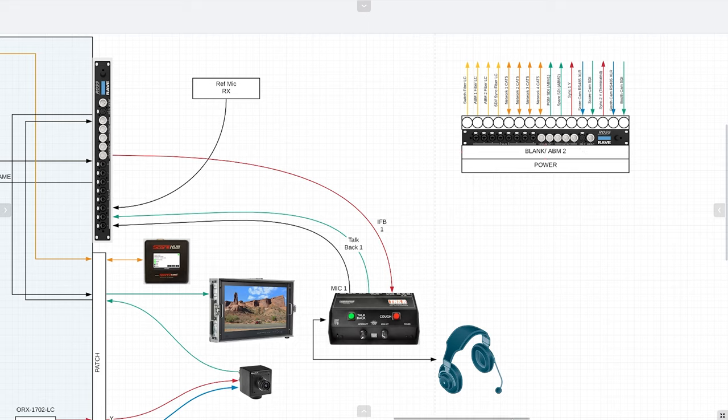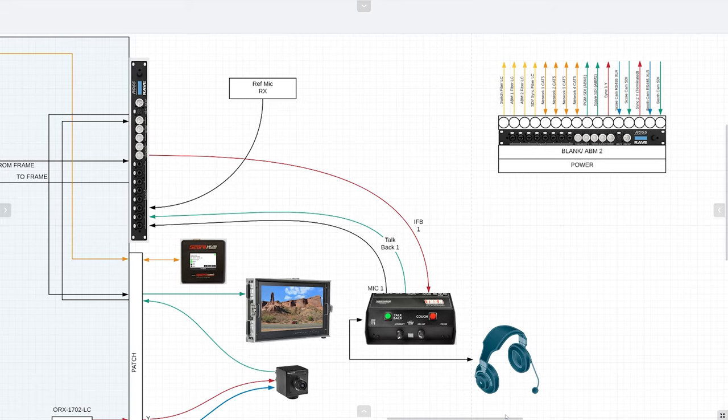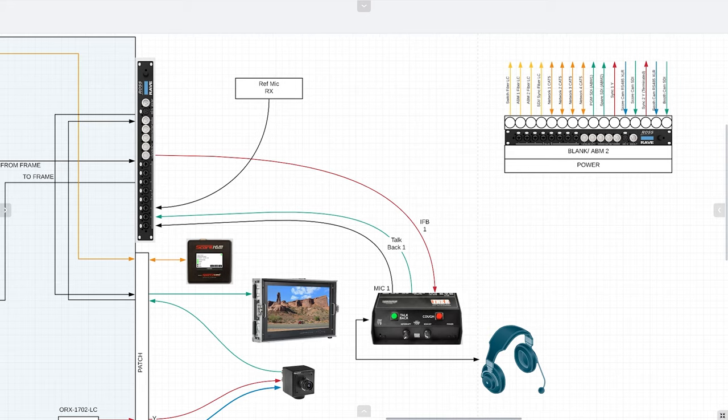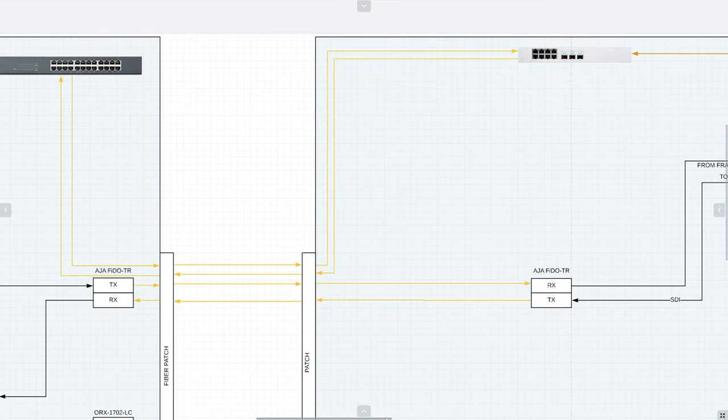So that's ultimately what the goal is for this little breakout box: we're going to take all those signals from these four fiber pairs through here, and then within here we are going to internally distribute those signals to these either BNCs, XLRs, or Cat5 connectors. So let's see what that ultimately will look like. If we come over here,